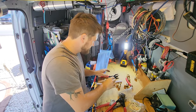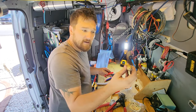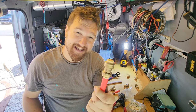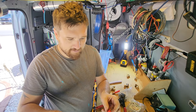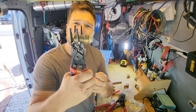Here's a better way of doing things. I use SharkBites. SharkBites are awesome. You take a SharkBite, stick it on the end — boom — you have a waterproof connection. This thing is not going to leak and it won't come apart. You have to get a tool, which you could do with needle nose pliers if you need to, but you put the tool on the piece and — check this out — comes right apart.